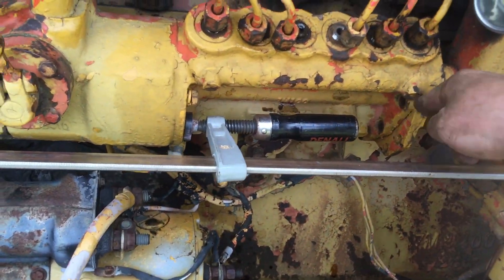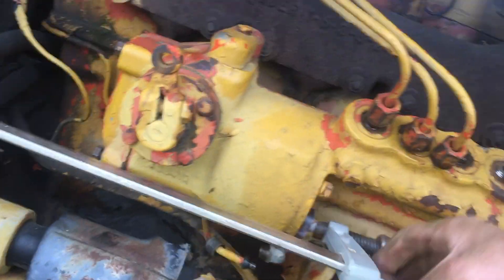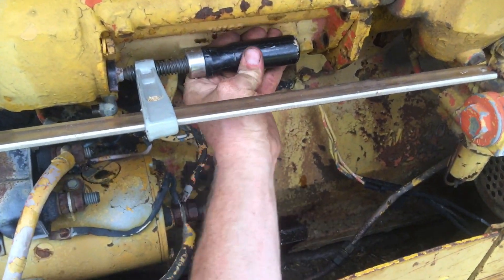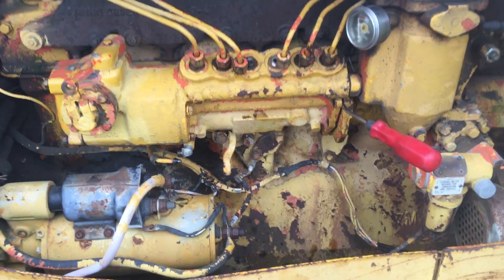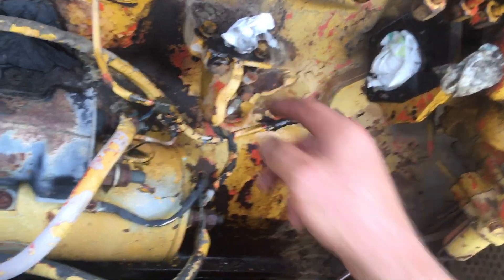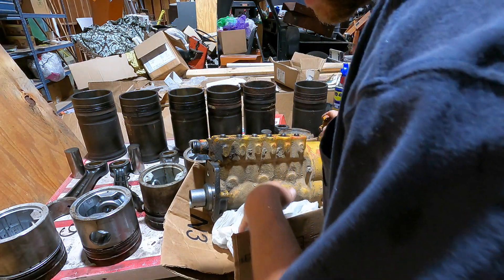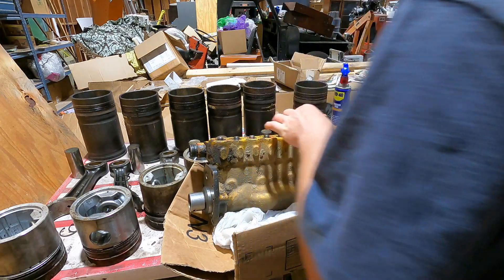I got it split here — got all these bolts out. Down here I think that's the oil drain. I'm trying to see if I can get it backed out. The lines are off. I'm just wiggling this back here and sticking a pry bar in ever so slightly, sliding it back. She's off. I stuffed some rags in here — this is just a slip joint, that's the oil drain. I'm going to take a peek inside this pump. The rack is supposed to move in and out.